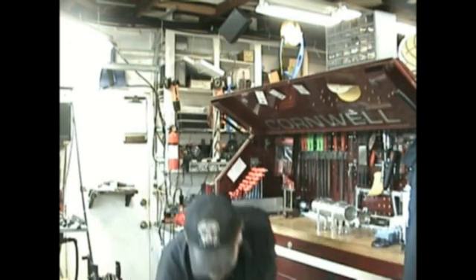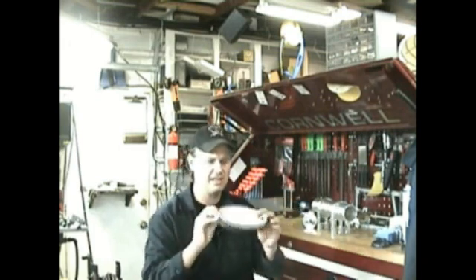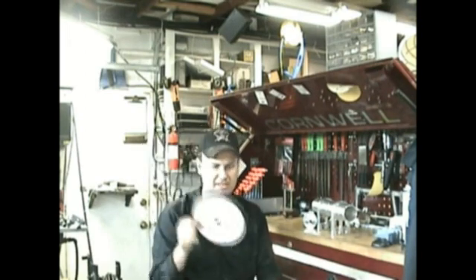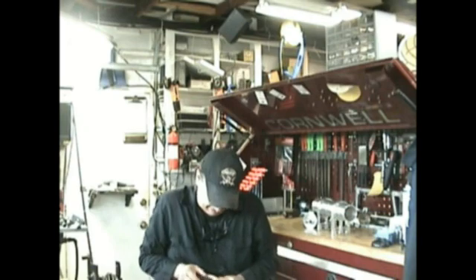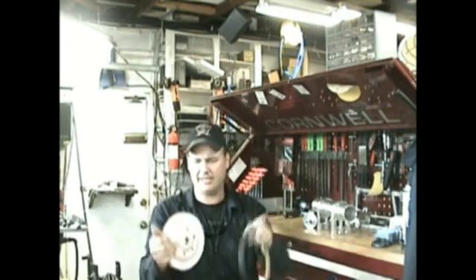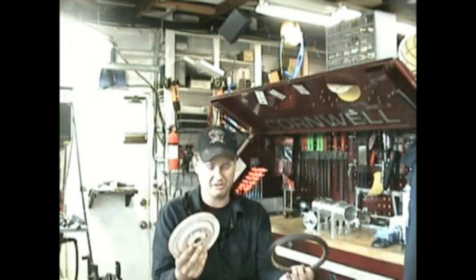The wheel originally looks like this — this is a pedal car wheel. How true it is? Not very true. It's really kind of a rickety thing. It's all just made of pressed steel sheet. The tire itself is nothing more than an oversized O-ring or rubber band — it sits inside that groove by its own tension. These are very lightweight and thin, but they are not very true, which makes it difficult to actually power a vehicle on them.